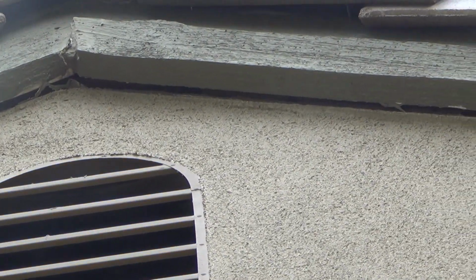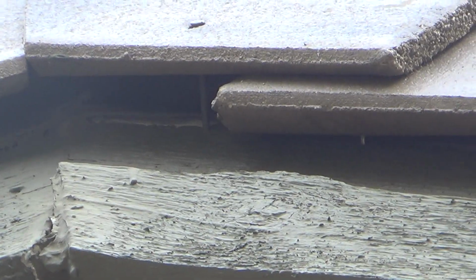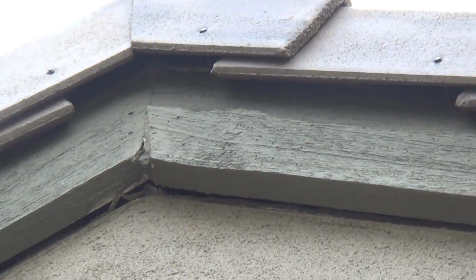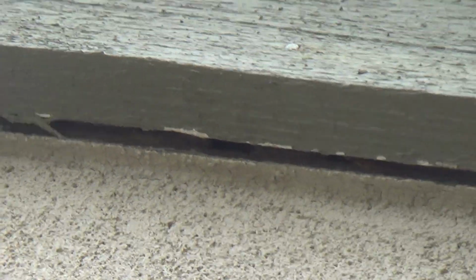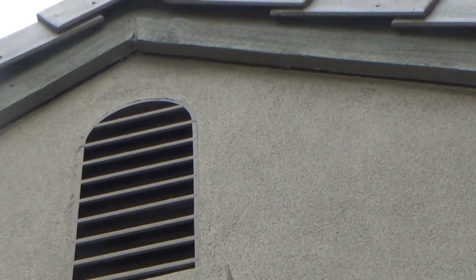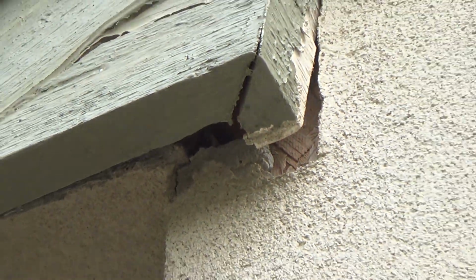That's because that one has split up there. Can you see right there? See how that is split right in half? I'll get out like that. Now maybe you can see how it's coming away. And that one there, I don't know. I may have to put a lag bolt there, and I might have to put a 3.5-inch lag bolt. And along this edge, I could maybe put some screws, but I'll end up using a lag bolt for sure right up in there to kind of suck that back.